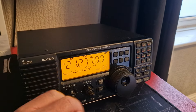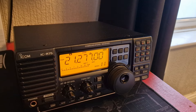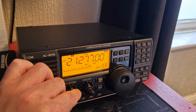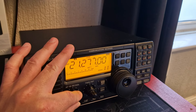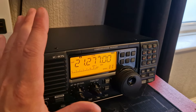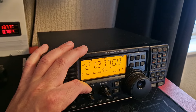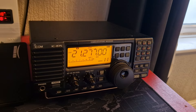Obviously the FM is adequate — I don't really listen on FM on it. You can tell it's not built for FM, mainly because the squelch isn't the greatest in the world. Really, squelch needs to be the ultimate goal on an FM radio: a very tight squelch and an almost non-existent squelch tail. So for FM it's adequate, sounds fine, but the squelch is a bit hit and miss. The absence of a dedicated squelch knob gives you a clue that it's not really made for that, but yeah, it does okay.